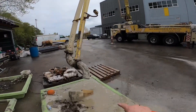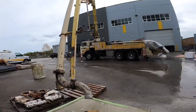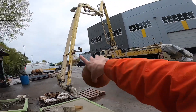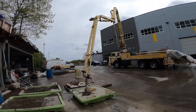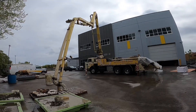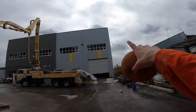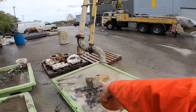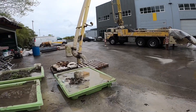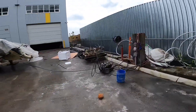The one square sponge, the clean one - that's the first one I tried to blow back through the boom with air and it wouldn't even build air pressure. The problem with square sponges is unless you have a high volume of air, the air will actually pass through them and it doesn't seal well enough to build pressure. So then back at the yard I put in a nice new rubberized orange foam ball, put that in the tip elbow, put air to it again, and yes it did build air pressure - but there was no movement. It only ran the air up to about 40 psi. With 40 pounds of air it's not going to move. I don't want to go 80 or 100 because god forbid if I did break it free, we might be paying for some new windows. The last sponge is the one I put in the back end and pushed through with water all the way through the boom - pushed her out nice and clear. There was hardly any concrete in there, just a little bit of rock pack and one damaged sponge.